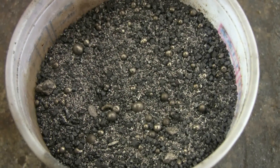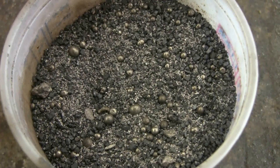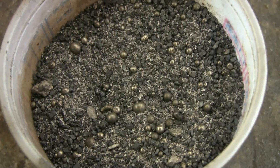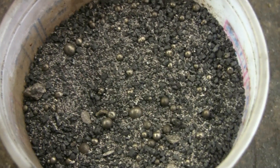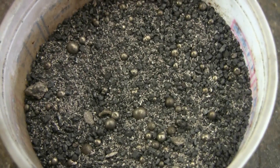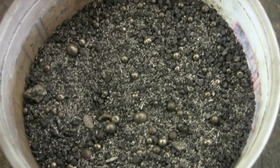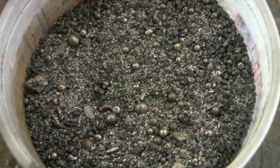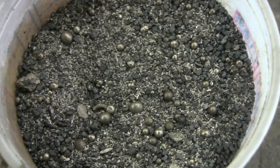Here's a close-up look at welding thermite. It has a lot of additives in it that the normal orange-colored military thermite doesn't have. As you can see there's a lot of steel balls in here that get melted by the thermite reaction. The result is a lot of liquid steel is formed, and interestingly it's a hardenable steel. There's also a lot of flux in here because it forms a slag on top of the steel, very similar to what you get when you stick weld and then have to chip the slag off your welds.